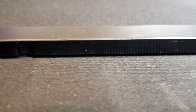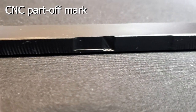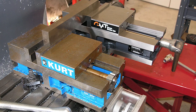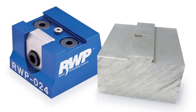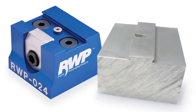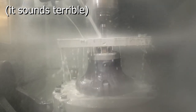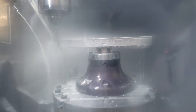It turns out that machining things isn't that straightforward, and machining something well is a whole other beast. A blade spinning at thousands of rotations per minute exerts a ton of force on the metal block it's cutting. Machining a part requires good work holding, which is what holds the part in place. Poor work holding or thinner materials can result in chattering, which is an unwanted resonant vibration. Chattering tends to create a very bad machine finish, and while I could have sanded it away, if I did that, you wouldn't be watching this video right now, and I would still be sanding.